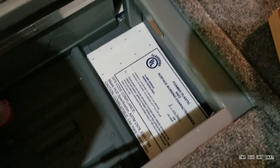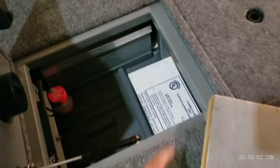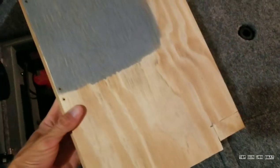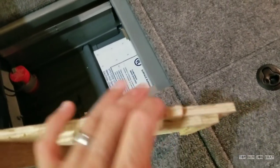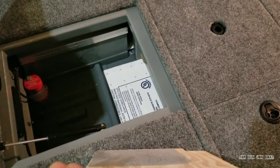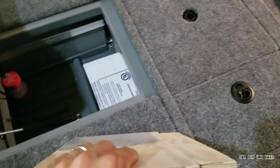The first thing I did was cut out a piece of quarter-inch foam as a spacer — the same way I did my floor system in the boat. This gives more foam for buoyancy in case I spring a leak, and also gives me a way to space up to the rib when I put my plywood on top. It also helps with vibration — instead of having raw wood beating on the aluminum hull, I've got that layer as a cushion, almost like when you do hardwood flooring and put that layer underneath. I added a piece of wood here and here to get me up to the height of that rib.